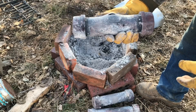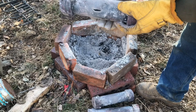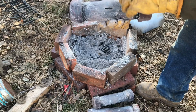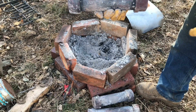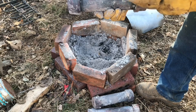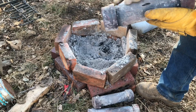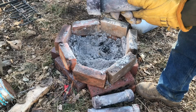Here's that pipe that split. I said earlier I had it in the forge just like this and the flame was hitting right here, and right here is the seam that split. That tells me the seam runs right along here. The flame was hitting one spot on full blast and I wasn't paying attention. Mistakes made: I wasn't paying attention, wasn't rotating it, and brought it up to heat too fast. The campfire brings the whole piece up to temperature at once; in the propane forge on full blast we brought it up way too fast.